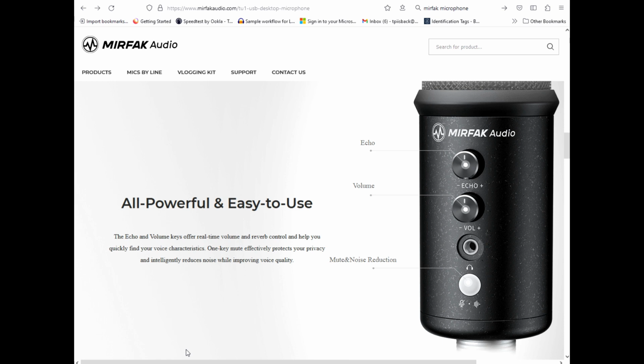Okay, noise reduction is off. The pop filter is out of the way. And all I want to do for this test is check the cardioid pickup pattern. So the microphone, there we go. It's directly in front of me with the knobs on the microphone pointing at my mouth. Now I will go off to the right side, my right, of the microphone, still speaking. Same distance behind the microphone. Same distance on my left with the microphone. And above the microphone from the top, speaking straight down at it. And now back to in front of the microphone.